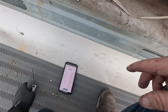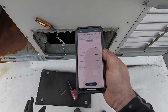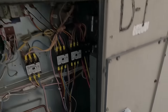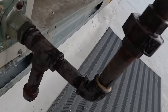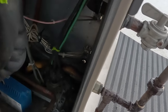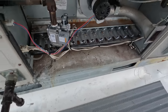There's 1.6 — we've got low fire done since it kicked back out, so we're good on that. Right around 30, 31, 32-ish — definitely under 40 for low fire. Then we go to high and we should be right in there under the 70 mark. Filters are fine; I checked those before I left. All right, got the soapy soap — big blue on there. No leaks, not even on the union I didn't take apart. No leaks on that back here either. Got all that back in there sprayed. Got the wire ties on there. Good to go.